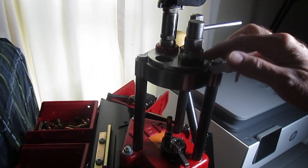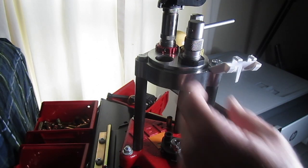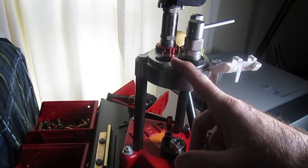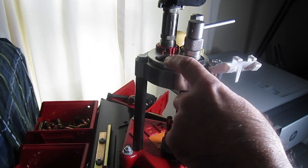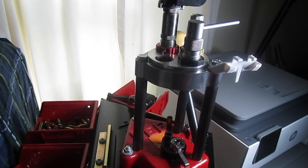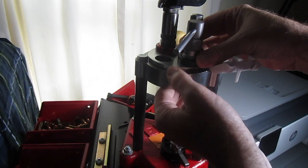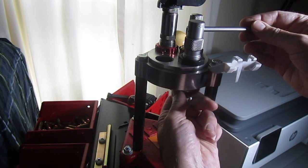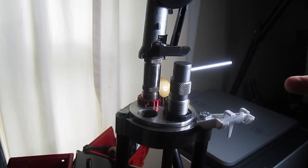We're at the press. I've inserted the die and removed the adjacent die to give me clearance to operate the handle. Now, about using this on certain presses — some people may wonder if you can use this on a turret press, and the answer is yes. You may have to remove the die next to it because when you operate the handle it might get in the way. The other issue is that when you operate the handle and it tightens around the bullet, it may actually move the turret head in the process. It will work fine on a turret press — just make sure you hold the head of your turret when you operate the handle.